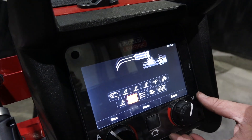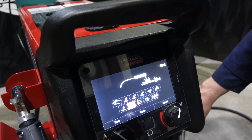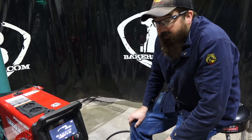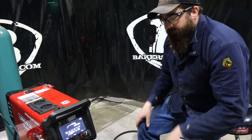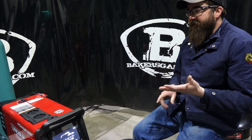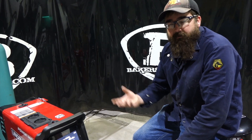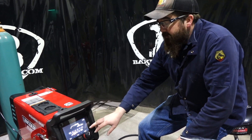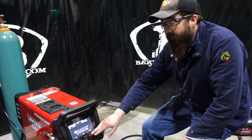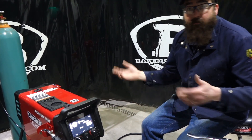The next setting in the menu is stick. This thing also has DC output on stick. You just hook to the lugs inside the machine with your stinger and your ground - pretty simple. I've stick welded with the 350 MP and they're awesome. Now, if you remember the 350 MP, it had toggles and switches where you had to know what code number you wanted - typically number 11 was straight CV MIG. Now they've changed to this style, which is more user friendly because you just choose your gas, material, and thickness and you're ready to rock and roll.